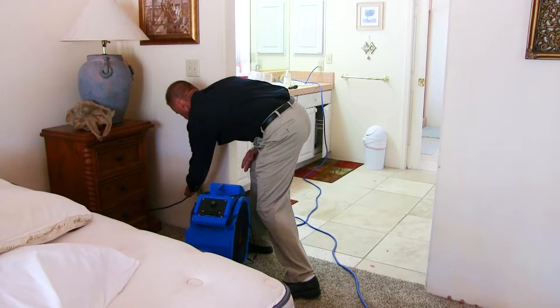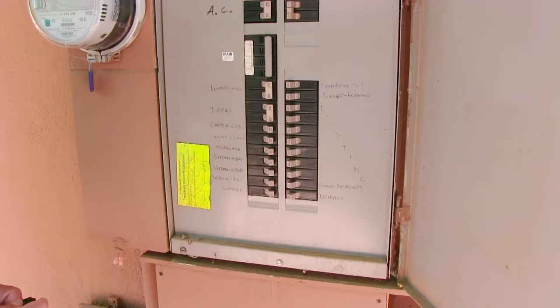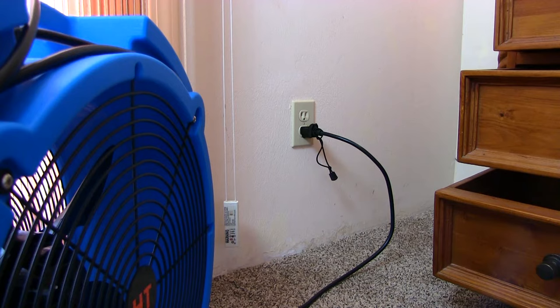I have a fan plugged into this outlet — they're very low amp, they only draw 1.8 amps each, so you can put six of them on a 15 amp breaker. Typically we're not going to worry too much about the fans, especially because most of the breakers I'm dealing with are 20 amp, which I know because we went out to the breaker panel and saw that the majority of them were 20s unless they were lighting.